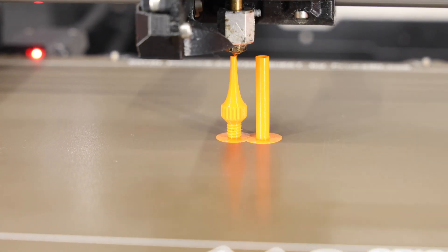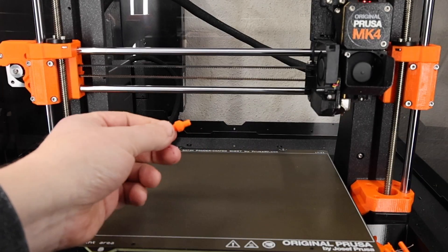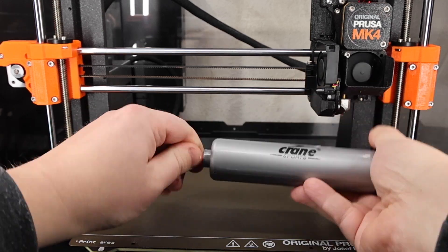Because it is also a bit fragile like metal needles, I recommend printing it with PETG to achieve some flex. I used PrusaMent PETG with 0.2 millimeter layer height and a brim, using the Prusa quality preset with 4 perimeters, so you don't need infill.